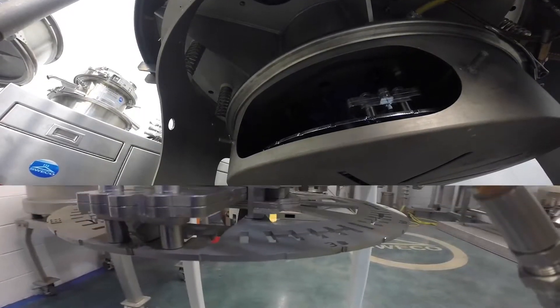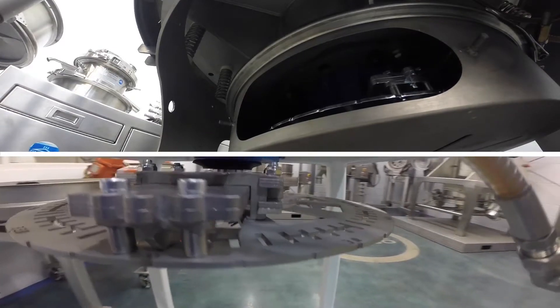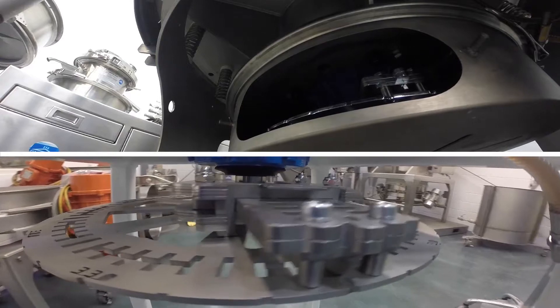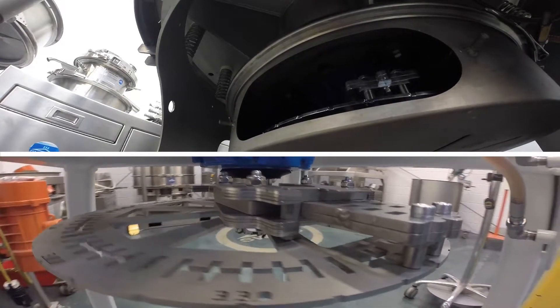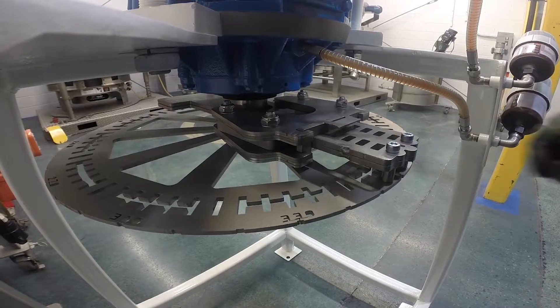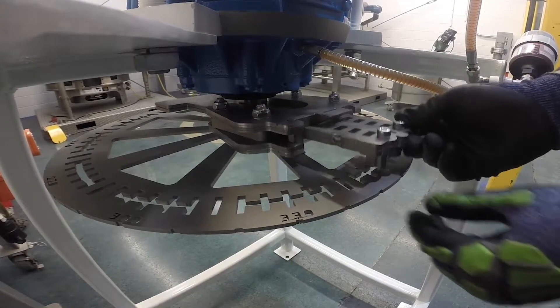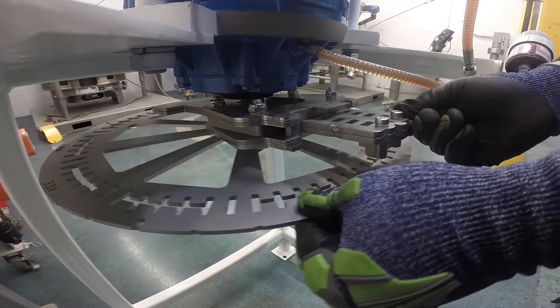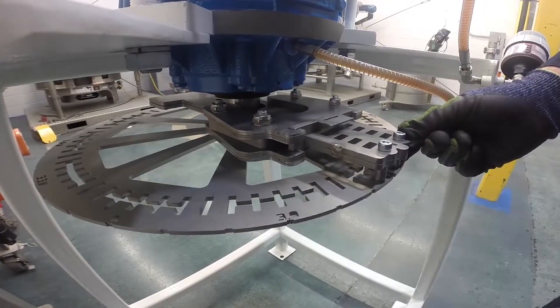To change the lead angle, reach into the lower weight panel and locate the carrier support plate and adjustable weights. The plate is slotted every 5 degrees, and these degrees represent the lead angle setting. Push the weight arm weldment towards the center of the bottom carrier support plate.